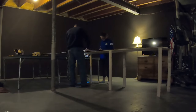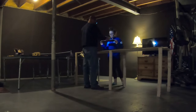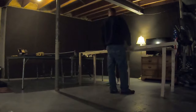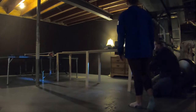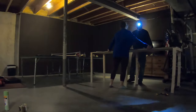to secure them. The reason why we added the decorative trim first was because we wanted the surrounding trim to be flush with the decorative trim. We realized it would be much easier to add the decorative trim first and then hold up the surrounding trim, making sure it's flush and then screwing it on the table rather than adding the surrounding trim first and hoping it ended up flush. After this, we started attaching the surrounding trim of the table.